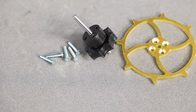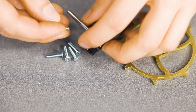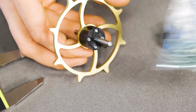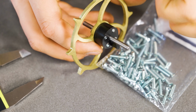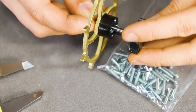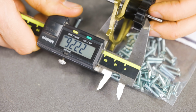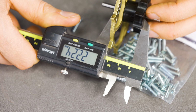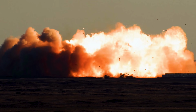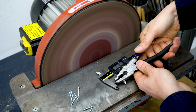Sourcing material is the least fun part of this whole project. I hate it. I'm so impatient. When I want something, I want it right away. And I ordered the wrong screw. So I ordered 16mm because I was sure that 20mm would stick out. But if we measure this, we see that a 20mm flathead bolt will be the perfect length. Need to go and order those. I'll be right back. I'm gonna manually shorten 8 screws to 20mm so we can assemble this today.